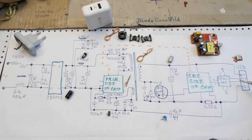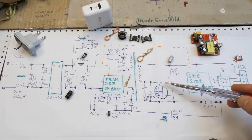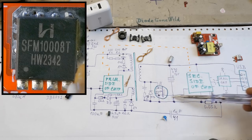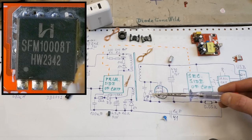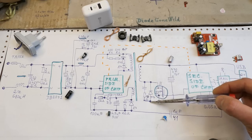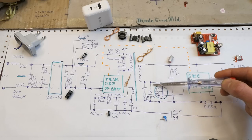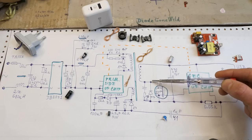Here is the secondary winding with the synchronous rectifier, the smoothing capacitor on the secondary side, the secondary side of the chip, a current-sensing low-resistance resistor, and the USB port. There is also the interference suppression safety capacitor between the secondary and primary side. There's a small chip connected to the data pins of the USB port communicating with the device - the charged device can request various voltages. There are multiple resistors, a couple of capacitors, and a diode in a voltage-sensing circuit, and based on the requested voltage, the switching controller aims at a different output voltage.